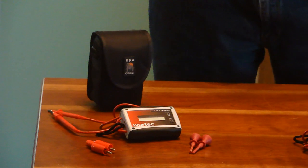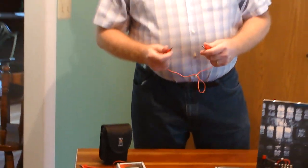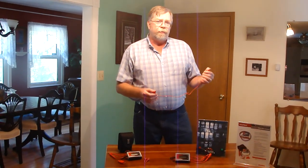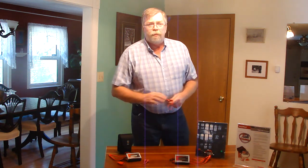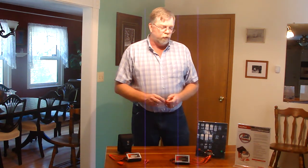There are also some bonus safety features in the fact that it is fused, so you have a little arc flash protection compared to the old-style jumper. If you got the jumper to ground or between two phases, the old-style jumper would act like a fuse and disintegrate. With this, you open a fuse, no one's hurt, and you replace the fuse and go back to business.